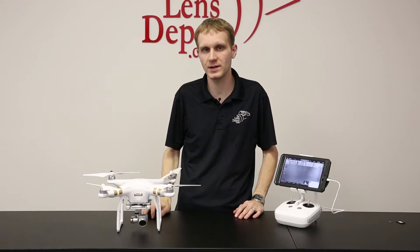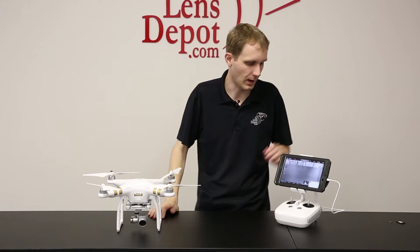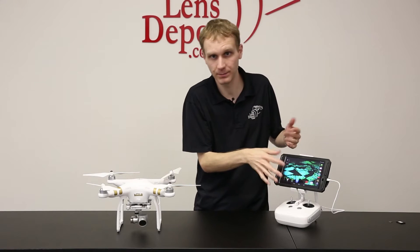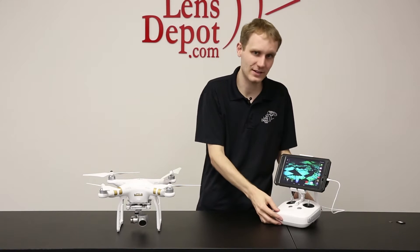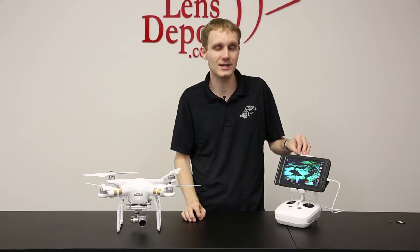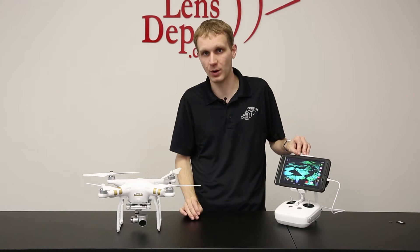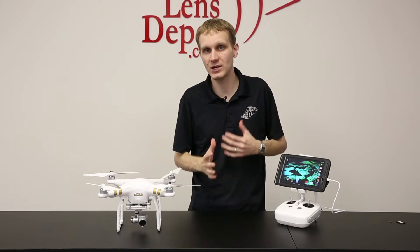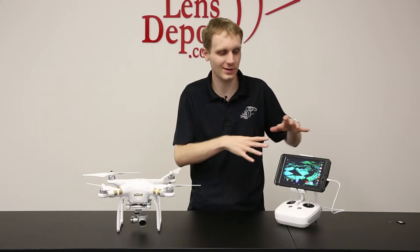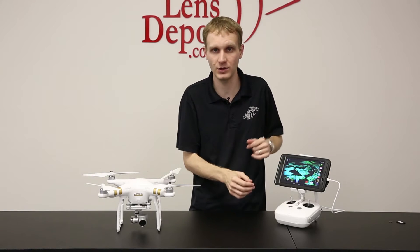So now we're ready to go ahead and start getting into getting the unit up for flight. First thing I would recommend doing is connect your tablet, turn it on, connect it via the USB cable. I would also go into your settings — you are going to need to turn Wi-Fi off and put the device into airplane mode. This will ensure that you don't have any sort of interference, or that you'll get a phone call or a push notification that will mess up any sort of performance on the unit while it's in the air.